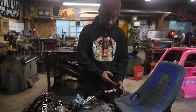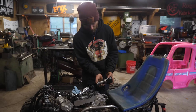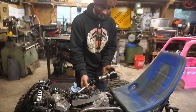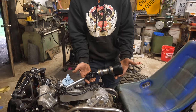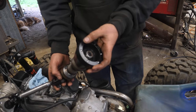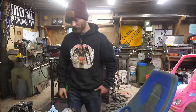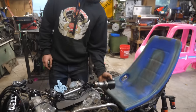I've got the steering shaft all assembled — we've got our little dog-bone dumbbell steering thing. That's all looking pretty. I might cut it down a little more and there's a little bit of adjustment, but that's all going to go something about like that, and we can just bolt the steering wheel to this. I'll probably end up making a steering wheel, but we have one for now that we can test fit. I think it's time to make a couple of seat mounts so I can sit in this, lean back, and feel where the steering wheel needs to be. Then we'll be really close to functional steering.